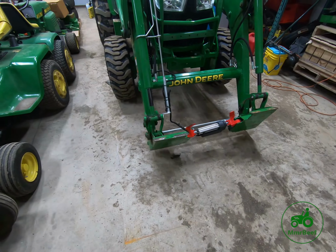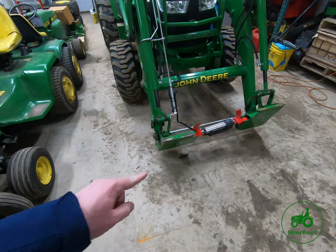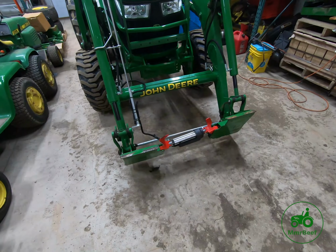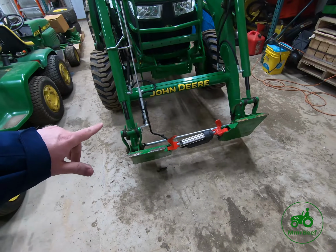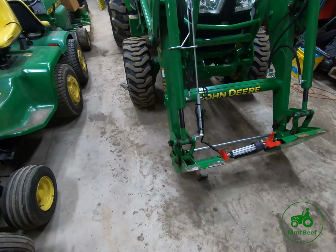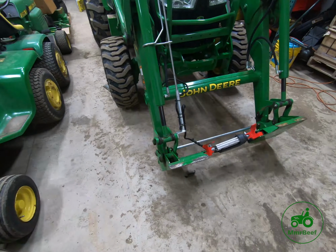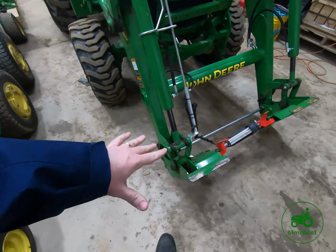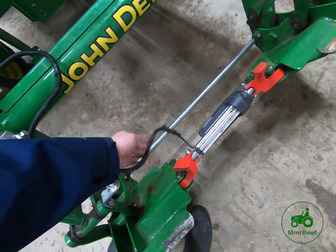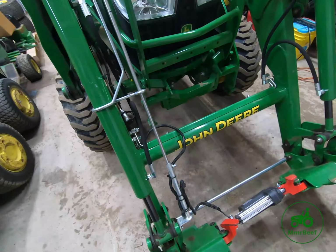To power it, we have to keep in mind that it is a 20 amp linear actuator. We know it's not under any significant load. I think we ended up using a 10 gauge wire all the way out here to it because of the DC electrics and everything; we lose so many amps. So it's got 10 gauge wire running to it. I really would like to firm up some of the wiring up here. This does present a few problems, just hanging out there with no bucket on it or anything. And we've got some excess wire just in case.